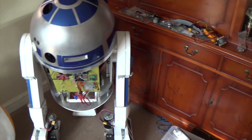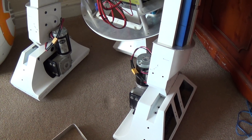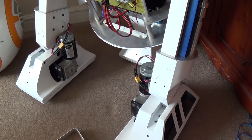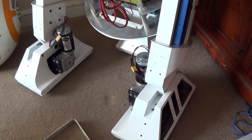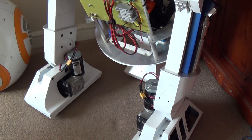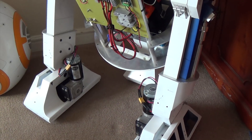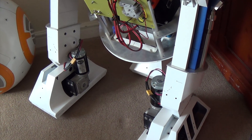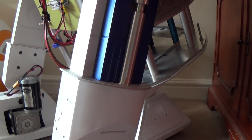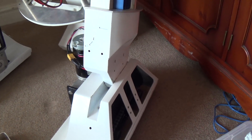Doing a bit of work on R2 this morning, trying to solve a little issue. These motors and the gearing is superb - in fact I've got to alter all the speed settings and the speed controller to slow him down. But there's still so much torque and so much acceleration that if he's in anything other than minimum speed and you stick him into forwards too quickly, he'll actually lift his front wheel. Likewise when he comes to a stop he'll sort of want to flip over backwards if he's going backwards. So there are various ways of locking these ankles - one idea I had was to put a bolt through here somewhere, but it's not going to be particularly easy without taking it all to pieces.